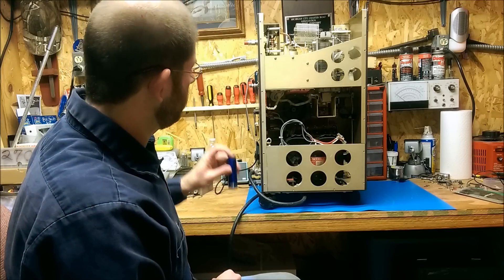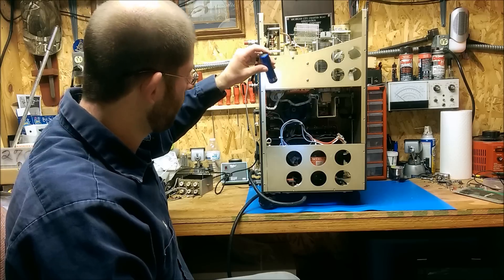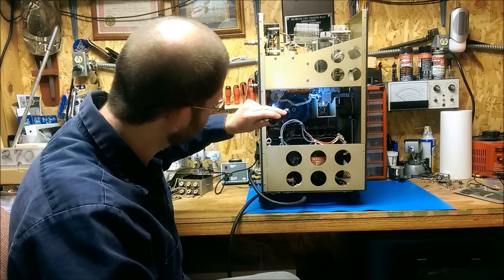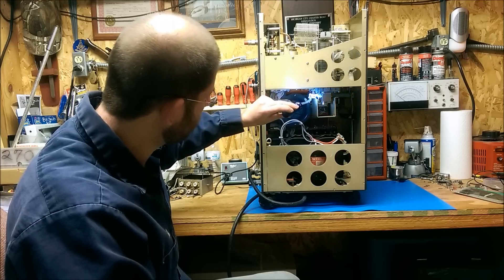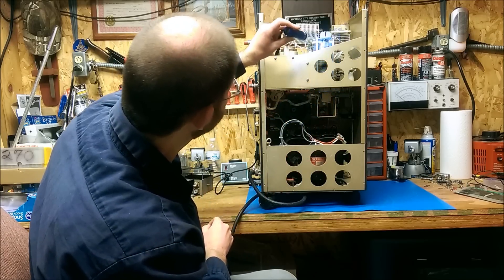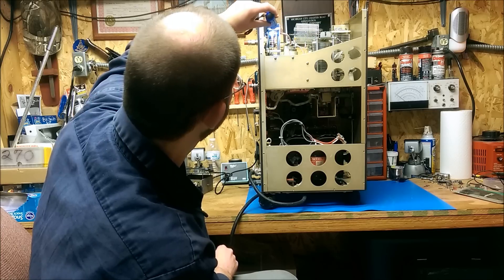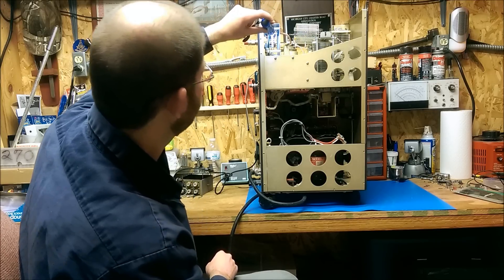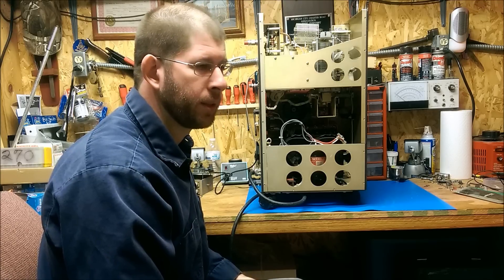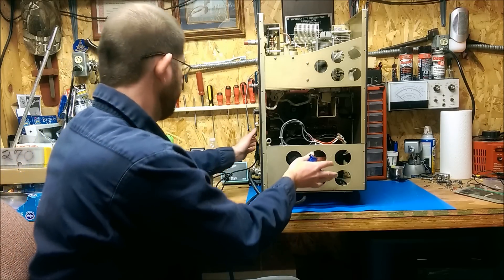Inside we have the Peter Dahl big heavy duty transformer, and as you look through you can see a squirrel cage fan blows air up through the tubes. Right here is one of the drive units — it has a little DC motor, gear reduction drive, and a coupler shaft comes down to the potentiometer. Directly above it is an air variable capacitor. You can see some of the various components — coils, and here's part of the RF board. It uses a vacuum relay to switch, and it's capable of QSK operation for CW.